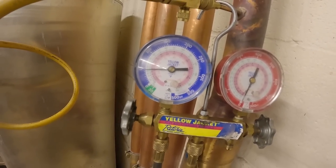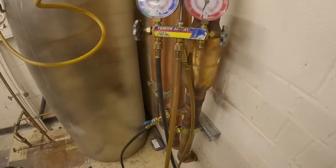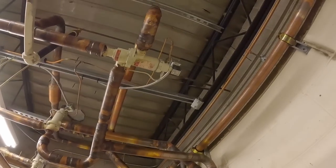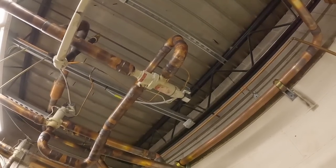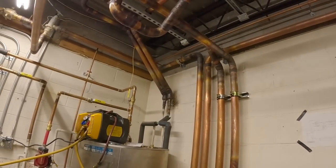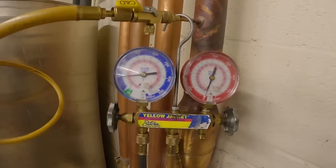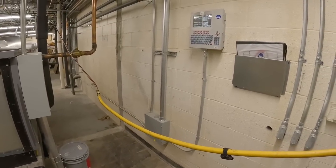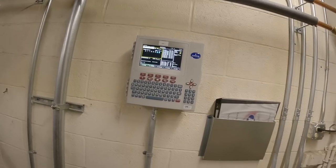The check valve is going this direction, so it's going to pull right through it and get everything out of there. We'll leave it at a slight positive — just enough to get it apart and back together so we don't have to pull a vacuum. On something like this, you can pull forever and it just wouldn't happen. The 3/8 hose makes a huge difference, and the biggest difference is the valve core tool. We're dumping into a suction side running 48.